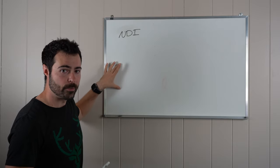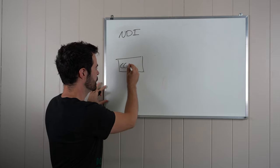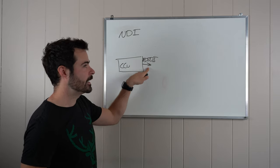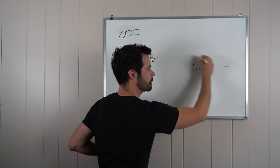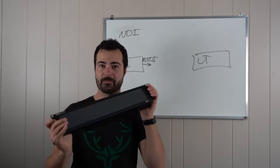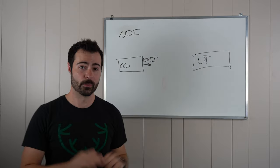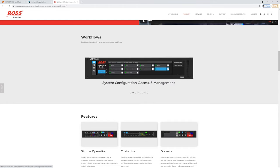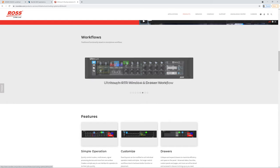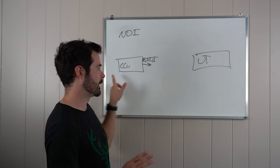Essentially, what I want to do is take my CCU's HD-SDI output and get it to my UltraTouch. What is an UltraTouch? It's Ross Video's 2RU touchscreen control panel whose sole purpose is to boot and run Dashboard, which is Ross Video's control software. By the way, this video isn't sponsored by either vendor. What I want to do is build a custom panel on Dashboard that's going to run on the UltraTouch. What's really cool about Dashboard is that you can make your own custom panels and it can take in NDI streams — so once a video output is in NDI, we can pull it up as a video window in our custom dashboard.